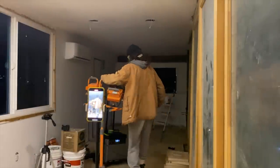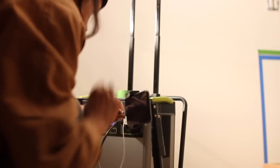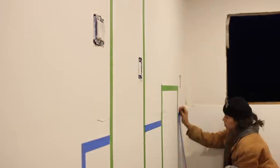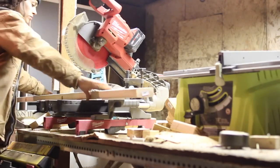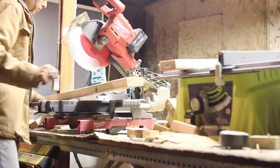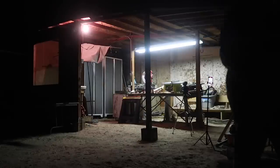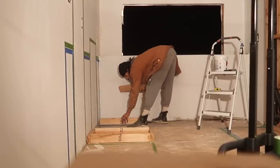I looked up the height of what the frame should be — that is 34 and a half inches. When you add the countertops, it should go up to 36 inches. That's what you see me taping out in blue, just to ensure I like where everything's going to go. Once I was happy with the tape placement, that's when I started cutting down all my two-by-fours. Realistically I could have used two-by-twos or one-by-twos, but if you're building actual cabinets this is what you'd use — I didn't want to compromise the material and have you build a less sturdy structure.